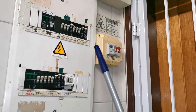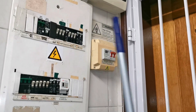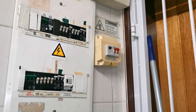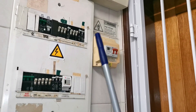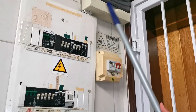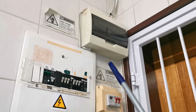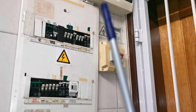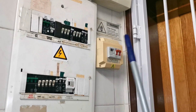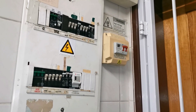It's actually better to have your earth leakage down during load shedding anyway, so when power returns you're protecting your devices from a power surge. I hope that is clear. If you are planning to build a house, make provision for a nice big space for your utility power as well as your backup power, so you don't have to have cables running on the surface or surface-mounted things like this. Depending on where you plan your DB, you may want to consider that.